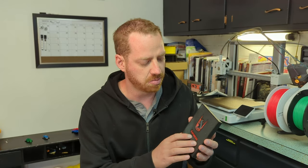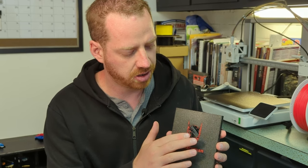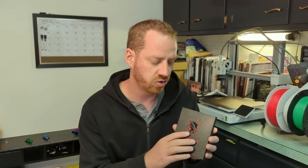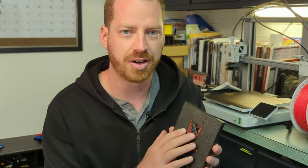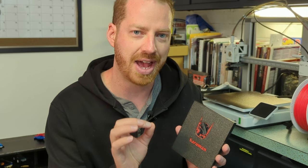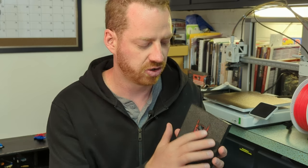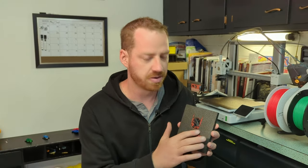This brings me to the last mistake I made, which you can kind of see right here. What I was doing is extruding the image slightly, and so what the printer tried to do is bridge across that to create it. I ended up figuring out that instead of extruding the entire image slightly, you go in and make a small border of your image and extrude that instead. The results are much better — you're not forcing your printer to bridge this entire gap, and as good as my A1 is, it's just not going to be able to bridge that far.